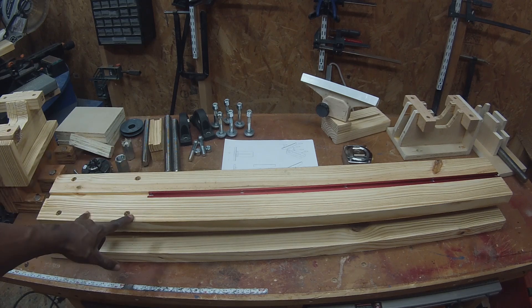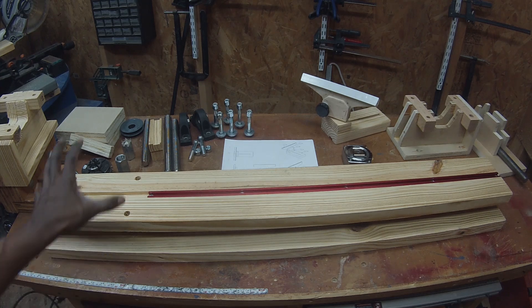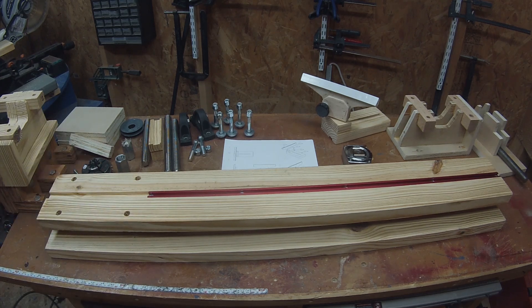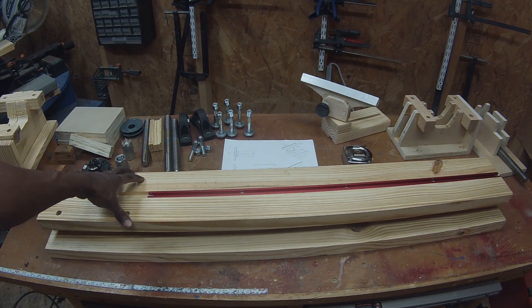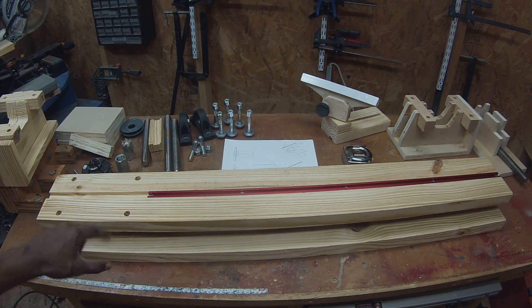There are four bolt holes which are designed to bolt down the headstock. I wanted to be able to remove the headstock and put it back on, but also once it's in place, I wanted to be able to fix it really tightly — and so that's why we're using half-inch fasteners.